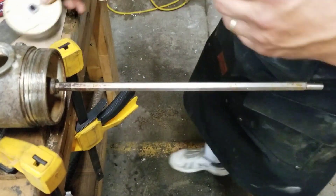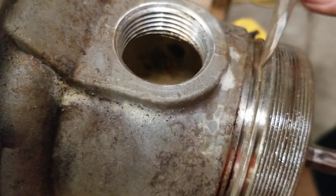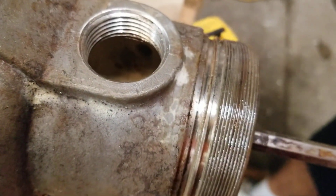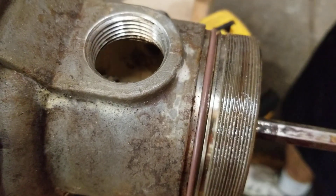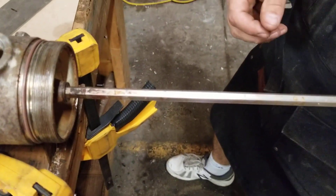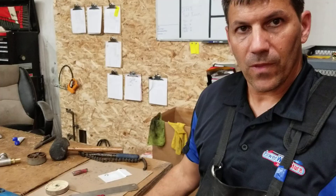I'm going to pull these off and make sure I don't get any of the shims stuck in the bowls again. I'm going to put my O-ring on. You can see there are two different grooves here — an outer groove and an inner groove. That wider inner groove is where this O-ring sits. So we're going to put that in there, and then I can go ahead and start reassembling the diffusers and show you how to put it on the end of the barrel.